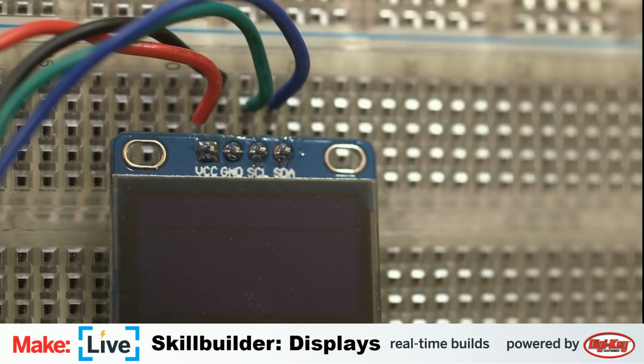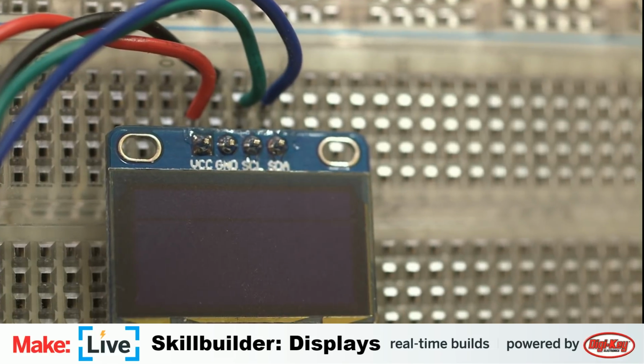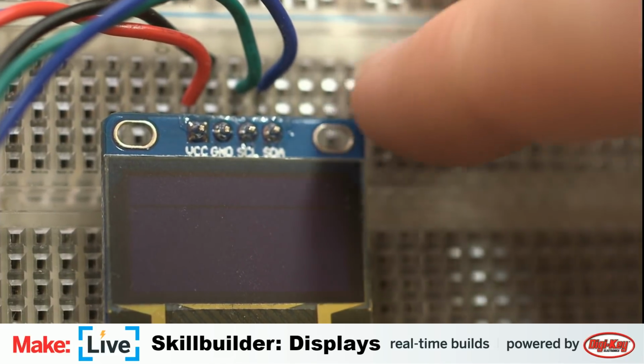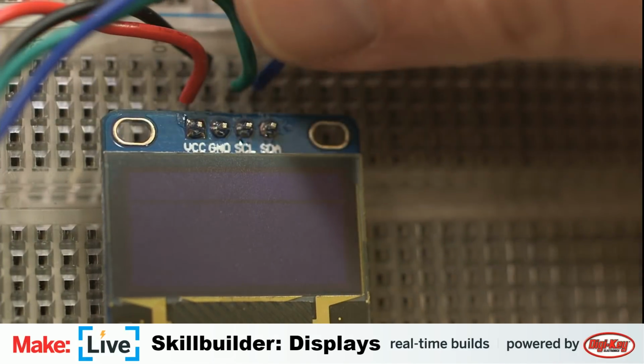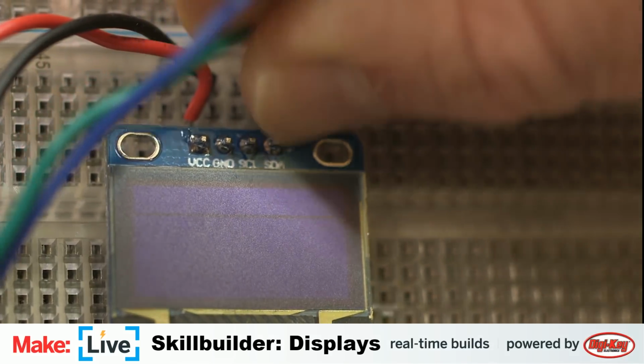The other thing, it's probably not really of too much consequence here, but it's worth always checking on this stuff, because you may remember from our last two I2C things, the 7-segment backpack and the LED matrix, that the clock and data pins were in the opposite order. So we do need to take these and swap them before this is going to work.